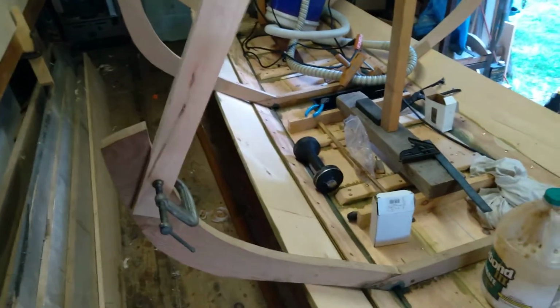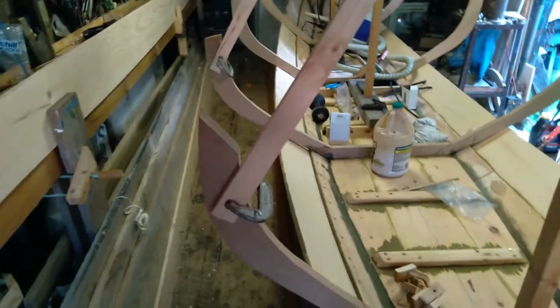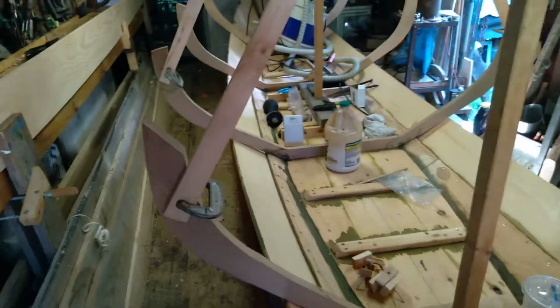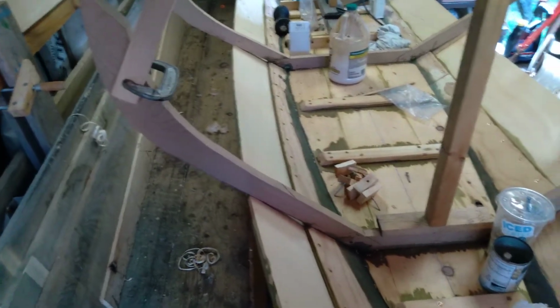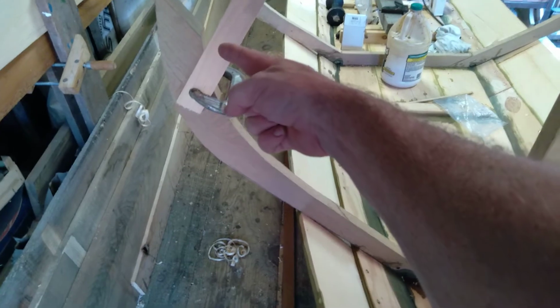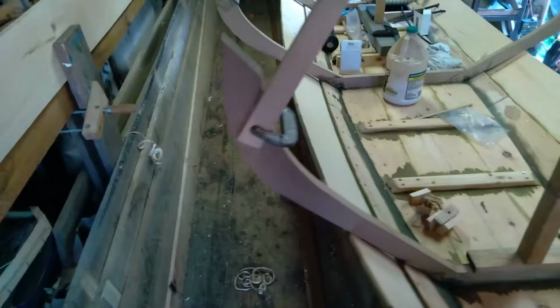Now in a dory construction, these boards are too wide and they're too thin, and also they're pine, which is more brittle, so it won't edge set like oak does. And I'm not sure what Samson Boat Co. is using, but apparently it edge sets okay. But anyway, a pine board of the dimensions that we're using here will not edge set. When you try to edge set it, it'll buckle. So if I try and pull down here, it'll bow out on the bottom edge in the middle there. It'll flex out and it'll want to twist as well.